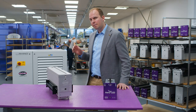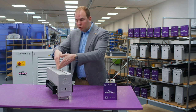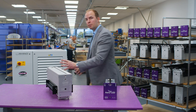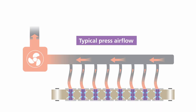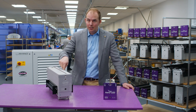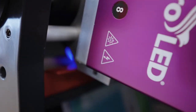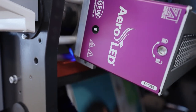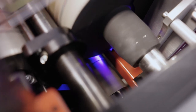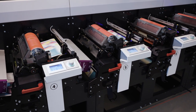Aeroled has a unique air cooling concept, using the same fan and ducting arrangement as the industry standard E2C. Air is pulled through the lamp heads and ducting before being extracted by a single centralized fan sited away from the press. This means no irritating high-pitched integrated fans or any delicate electronics inside the lamp which can easily get contaminated and damaged. There's no heat exhausted onto the press which can affect the print quality and ambient temperature for the operator. And importantly, air movement around the print stations is eliminated, which reduces the risks of hickeys or other print defects caused by dust kick up.